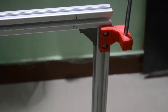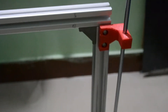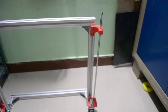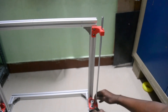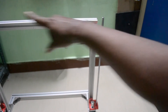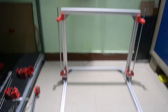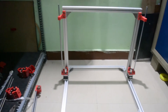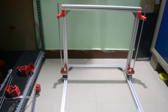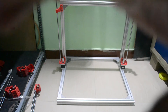You can place the smooth rod and check whether it is aligning properly or not on both sides. After that you can remove it, and while placing the X-axis again you can insert it. It should be aligned properly. Same way we'll do the left side — both sides smooth rod inserted and aligned properly. Now we have to place the threaded rod and smooth rod so we can install the X-axis.